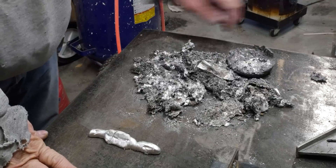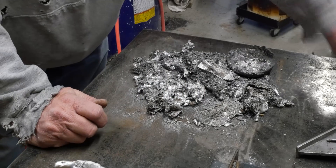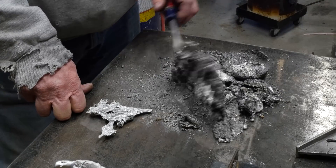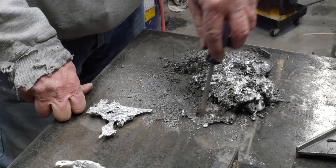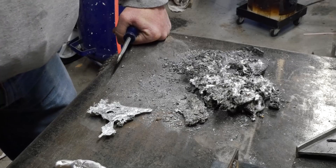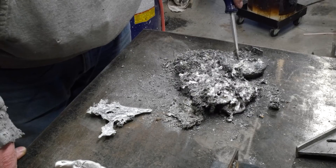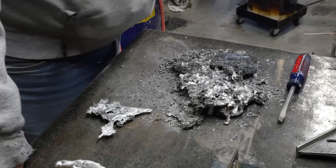There you go — this is swarf. Pretty amazing. I have some stuff here that looks like it could have been salvageable aluminum, but that all scraped off the top when I was scraping dross. Maybe if I had cooked it longer, maybe if I hadn't packed it so full — I don't know. But this is unusable to me now unless I melt it down again and get the few grams of aluminum I can out of there. A lot of that's still got a lot of dross in it. So next up we're going to go to the extrusion.